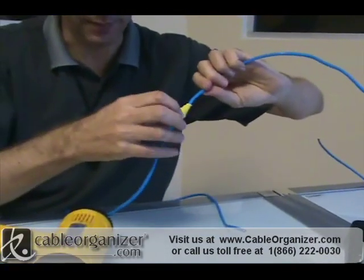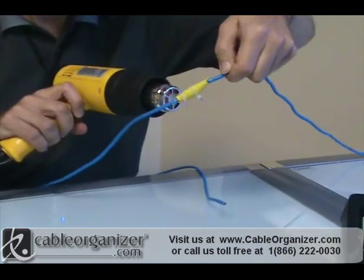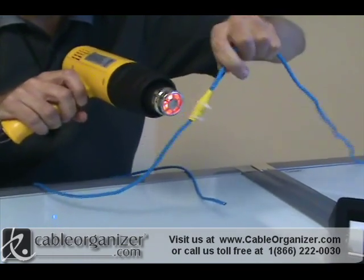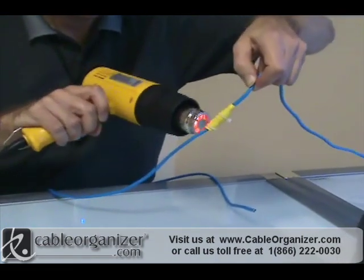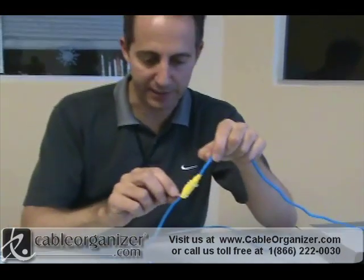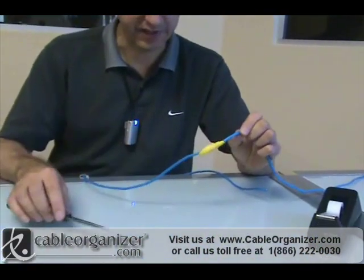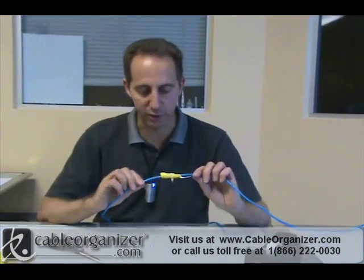You can see it starts to come undone a little bit in the middle, but you can just push it right back down there. Once you've got it down this hot, you probably don't want to touch it anymore — this will even come off right there. You can push it down like that and you have a nice connection. After it's cooled off, you can take off the remaining cable tie and the heat shrink will harden. The adhesive will harden and you'll have a nice bind over your product, keeping it over your splice.